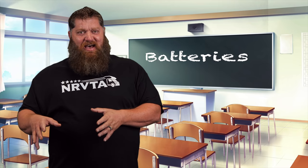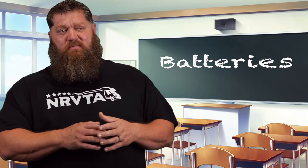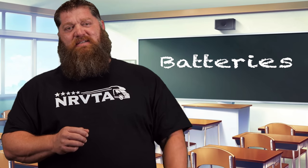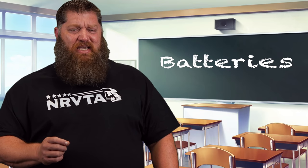When we're looking at lithium batteries, what we're really looking for is how much storage do they have. That storage is quantified in amp hours, and that lets us know how long we can run a particular item or a selection of items for a given amount of time. These batteries with Go Power are actually 250 amp hours each, for a total of 500 amp hours.